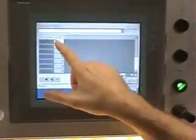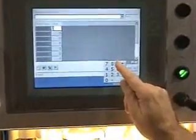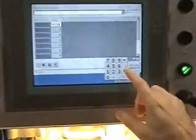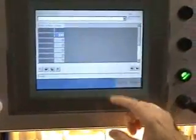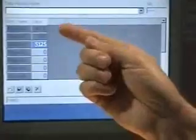You simply put your parameters in as absolute values from the starting position — how far you want each weld to be. For example, 9,000 millimeters out on the first one, then back to 100 millimeters away on the second one, and 5,125 millimeters on the next. It's a sequential program that starts the weld at these prescribed distances, and it can be very useful for complicated products.